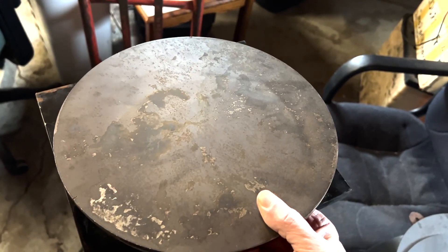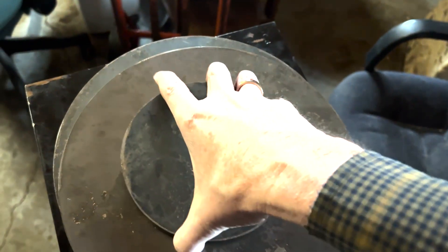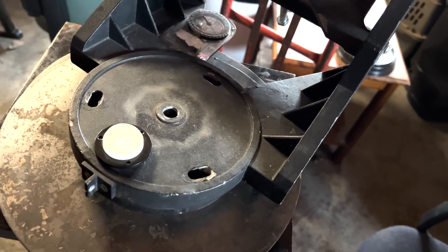I have these discs over here — these are quarter-inch steel plates. One will be bolted to the top here, and the second will be suspended over it, and that will be the leveling plate. Once we have that on, for both of the telescopes, I have some smaller steel discs that fit in the base of the telescope. Once we have these put together, we'll take the equatorial mount and mount it. Again, this will be aligned with true north and true south. Now that we know what we have to work with, let's go ahead and see if we can figure out what we want to do with it. So let's go to the drawing board and try and come up with a little bit of a design for this telescope.